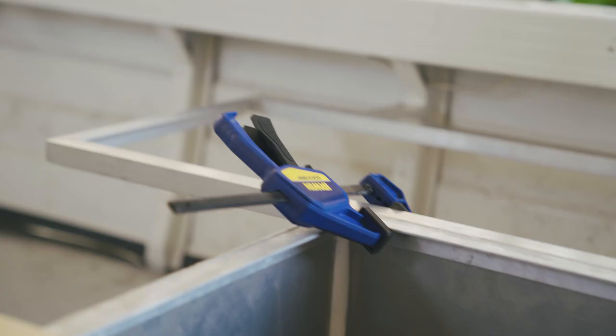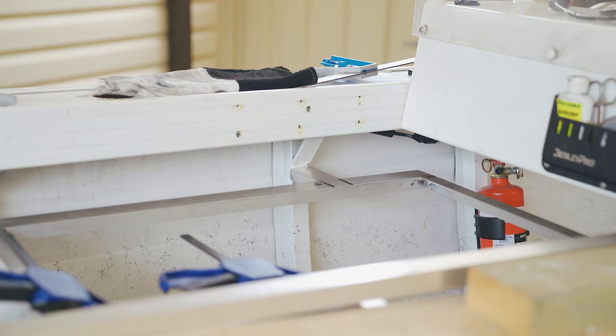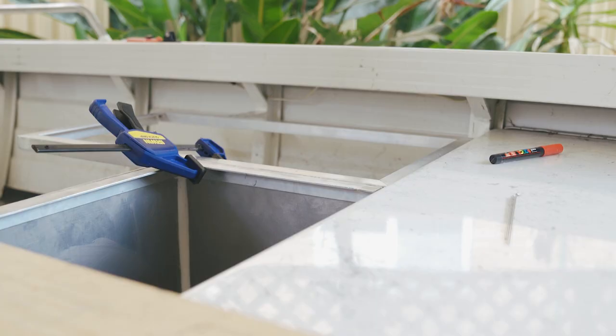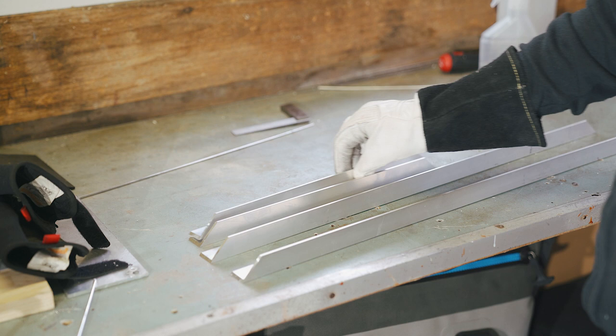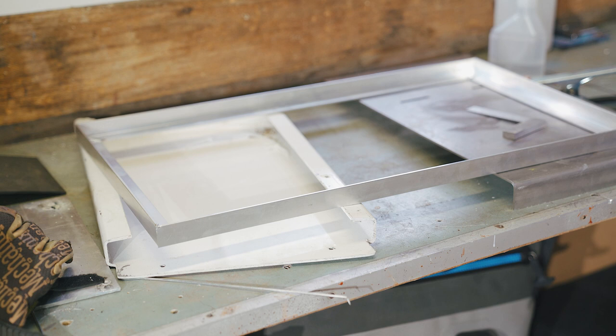With one frame completed, the other side came together very quickly with the build pattern essentially mirrored. The starboard side frame extended underneath the side console, which was an expected frustration, but the design was optimised so that vertical supports could attach to the existing floor trusses. Moving onto the centre hatch, the frame construction followed a similar suit to the sides. 45 degree mitre cut extrusions make for very easy square frames, and more importantly, a flat join for a flush mounted top panel. There are more intricate framing techniques that utilise channels to assist with water sealing and drainage, but it was honestly a little beyond my skillset.